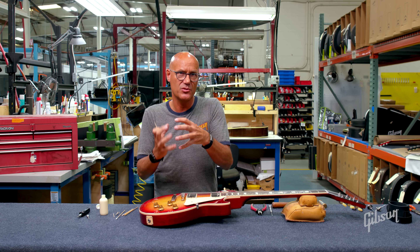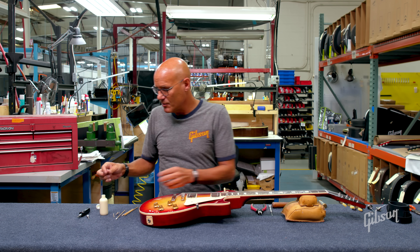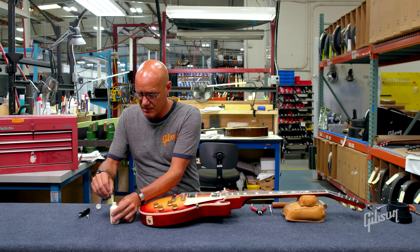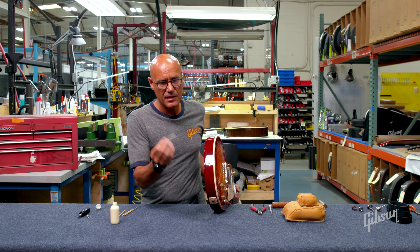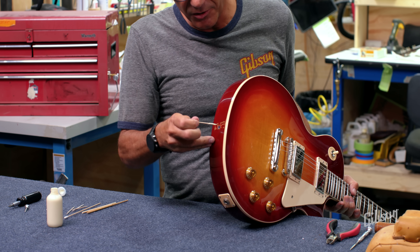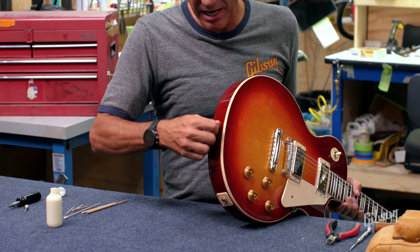You're relying on that glue to fill the pores of the wood and hold that dowel rod in. So when that glue is wet in the wood, it just kind of solidifies. And then when you go to thread it in, it forms around it and will actually be a lot stronger than just going into the wood itself. I'll typically take a toothpick, dip it in the wood glue, insert it in the hole, and then just snap it off.